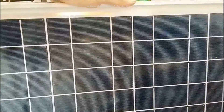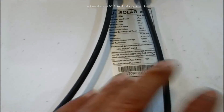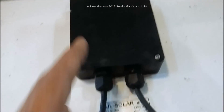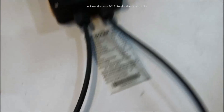I've got a five-year-old panel, it's double bus bar, not super strong stuff - 45 watt. I got 12 of these for $185, not a bad deal. These are UL Solar so they use the Bosch solar cell and they're supposed to be producing roughly 22 volts, but this one is not. Something is going on with the diodes in here and we're gonna go figure it out.